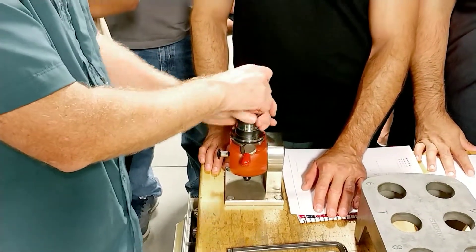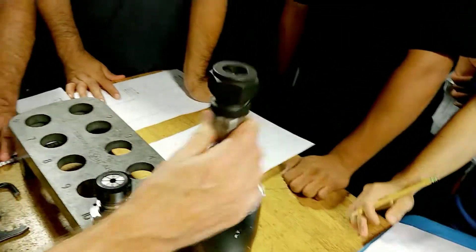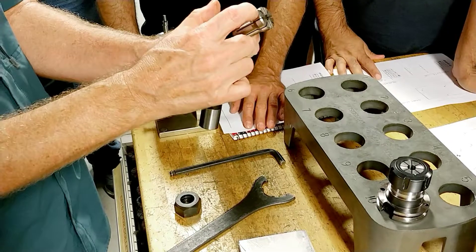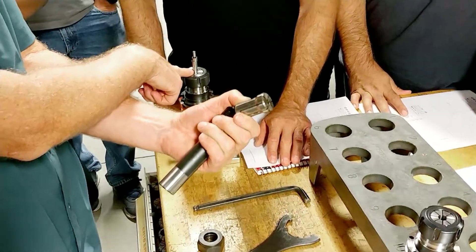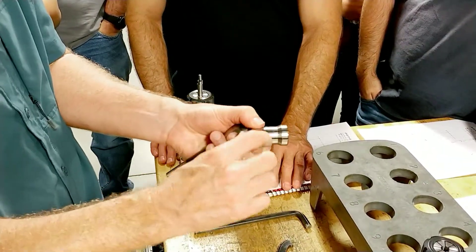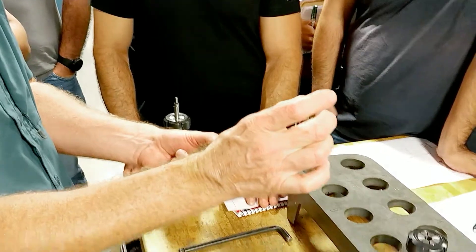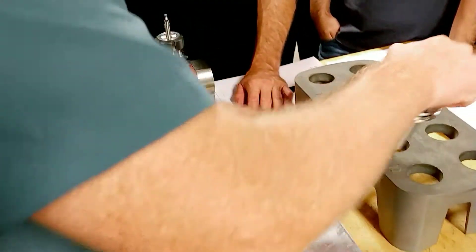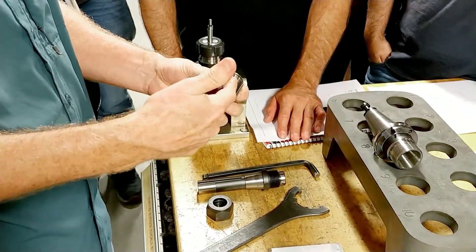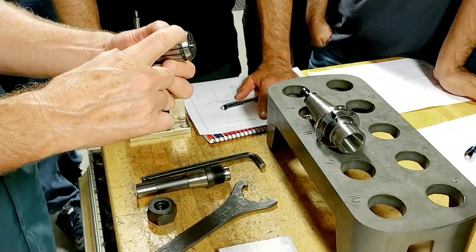There's also what's called the double angle collet system — this is called a DA collet. The double angle collet has no groove in it; it's a very simplistic collet. These hold pretty well, and a lot of shops prefer them. Some don't want to mess with the little snap ring, so they buy these. It simply compresses against the angle there and the angle there and smushes together. But with these you're really only getting the gripping force at the very top of your tool, versus the ER collet where you get the gripping force more evenly distributed across the tool, giving you a better grip.